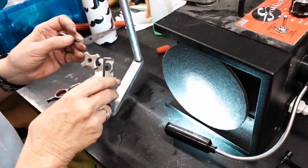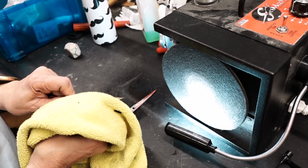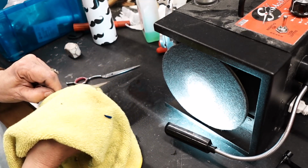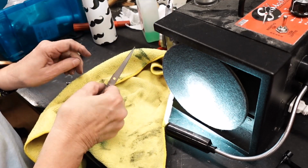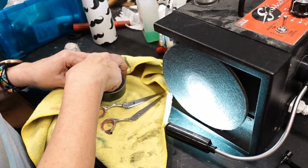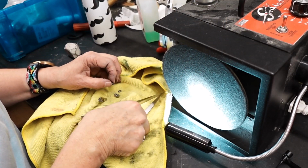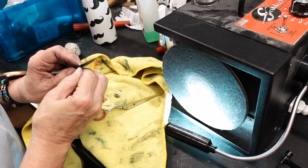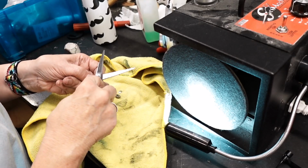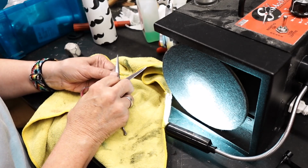Something simple that Henry was doing correctly and then is not doing correctly. So anytime you kind of lose your mojo, as they say, you kind of all of a sudden start getting complaints or you're not happy with your own sharpening, go back to all your steps, see if there's anything you've changed, watch videos again, and check all your equipment. Is there something wobbling on your machine? Is your water stone out of alignment? Needs to be worked on. Did you start doing something you didn't do before? Or did you stop doing something you were doing before? Just go back and check all your steps. I've had times where I've kind of lost my mojo and I have to stop and like, okay, maybe I need to flatten my stone, or that typically is what goes on.